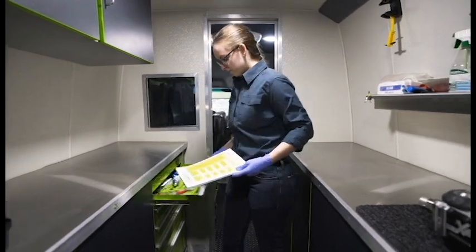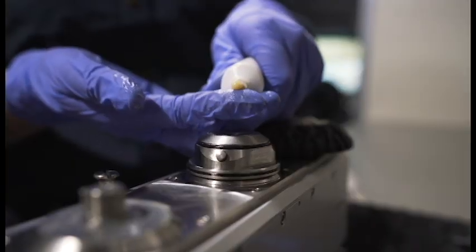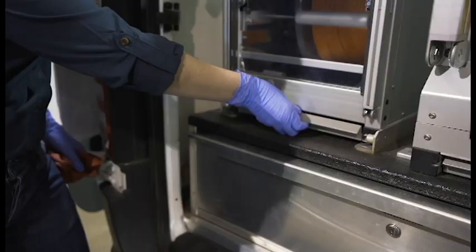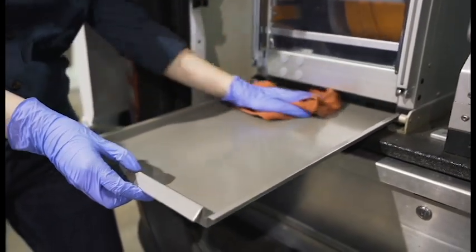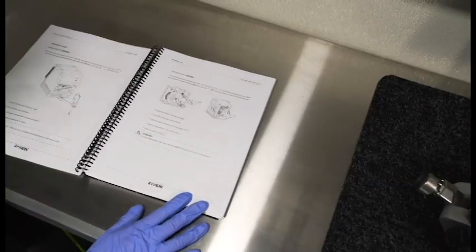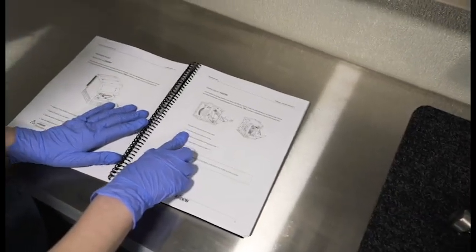There are a few things you should do every week. Fully clean and lubricate your quick change wheel hubs. Clean the drip pan below the cable reel. Be sure to grease your cable reel spindle every 200 hours according to your owner's manual.